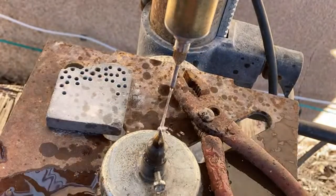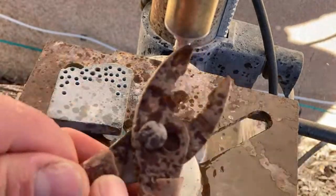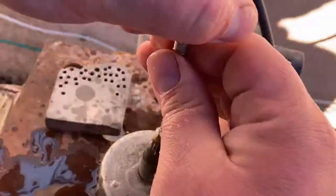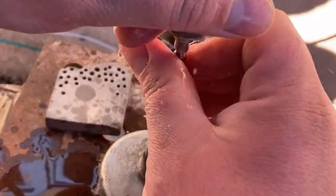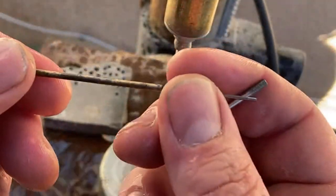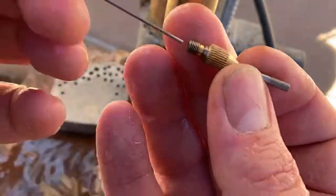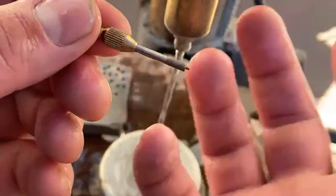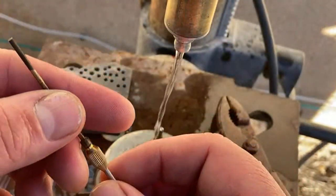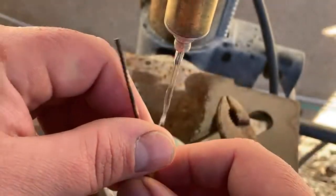So you can see the water coming through this bit here. I did forget to mention something very important. Half of the beauty of the Gunther drilling system is this injector pin. While it's coring, this injector pin keeps it from caking up and breaking the burr. I feel like that's what destroys a lot of burrs outside of just the diamond getting wiped out. These are sintered bits.